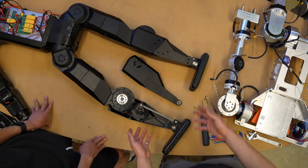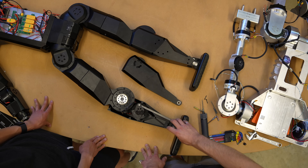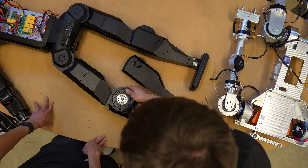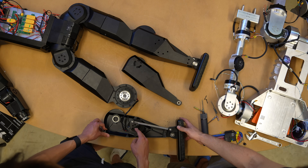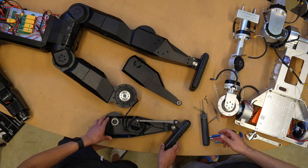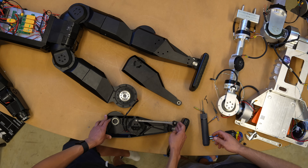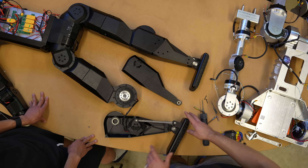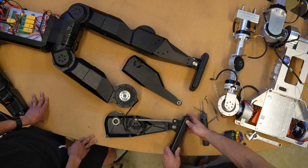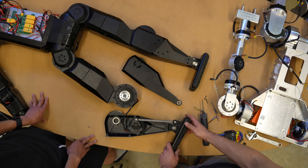With the side of the shin popped off, you can see the only actuator that is offset from its drive axis — here on the ankle. This choice is partly for packaging, but even more so for cost of transport: moving the mass up in the leg reduces the weight you're moving with each leg stroke. The linkage we designed is a parallelogram — the lengths here are equal and the angles correspond — making the robot really easy to simulate, with the joint directly at the same angle and torque output at the motor equal to that at the joint. On the foot, we went from an initial flat-footed design to a capsule design, partly for dynamics, but even more so because the capsule rounded edges play a lot nicer in simulation in Mujoco.